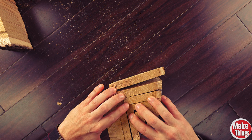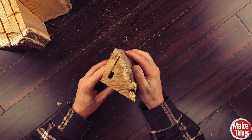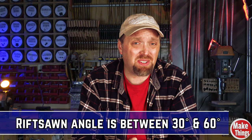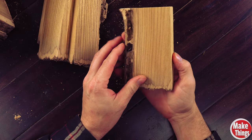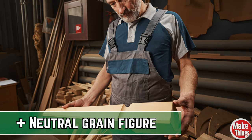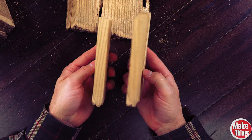The second product of the quarter sawn cut gives us rift sawn, or bastard sawn lumber. Looking at the quarter sawn pieces, it's the very inner part of the quarter sawn cut that is considered rift sawn. The growth rings on these are between 30 and 60 degrees. While rift sawn is very similar to quarter sawn, there are some differences. Visually, you'll see a more tight grain look like stripes — gone are any traces of the cathedral arches or the medullary ray patterns. But those lack of details can actually be a good thing. For example, if you're looking to add legs to a table, rift sawn boards will give you straight uniform grains on all four sides, so you won't have a cathedral pattern on one leg and straight grain perpendicular.